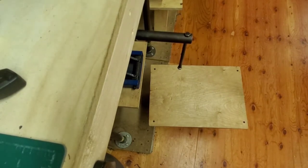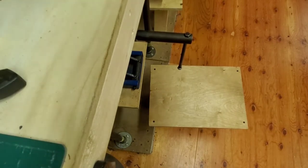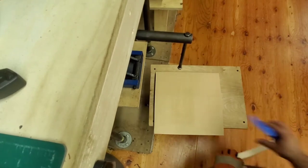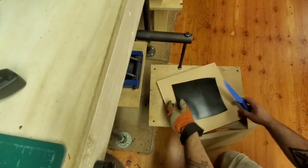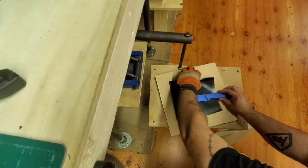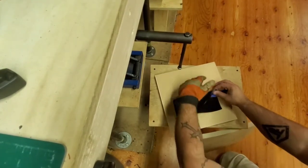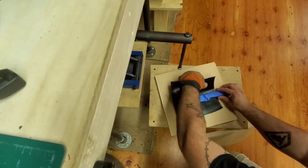What we'll do with the knife is the dull edge goes in the bend. So I'll show you that. This is brand new foam too. I'll just let you know how this works. All right. So, blade in. I'm pushing the blade forward as I'm pulling the Kydex. And you want to try and get it as close to the middle as you can.